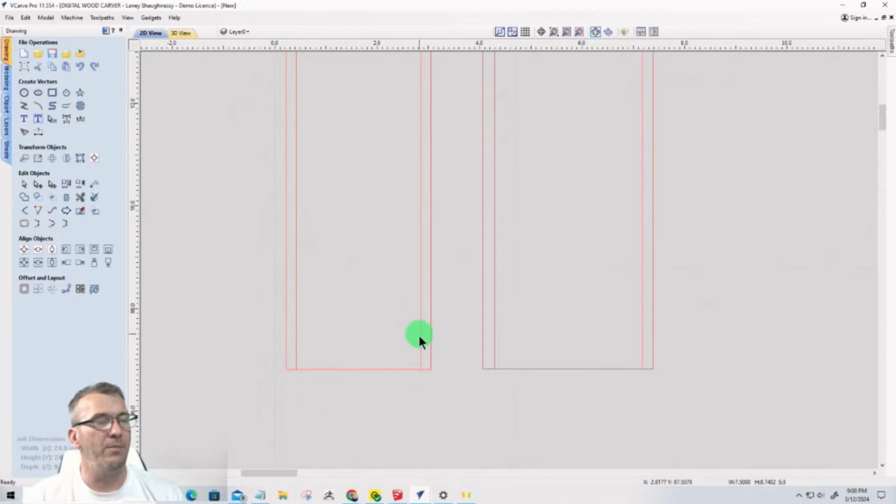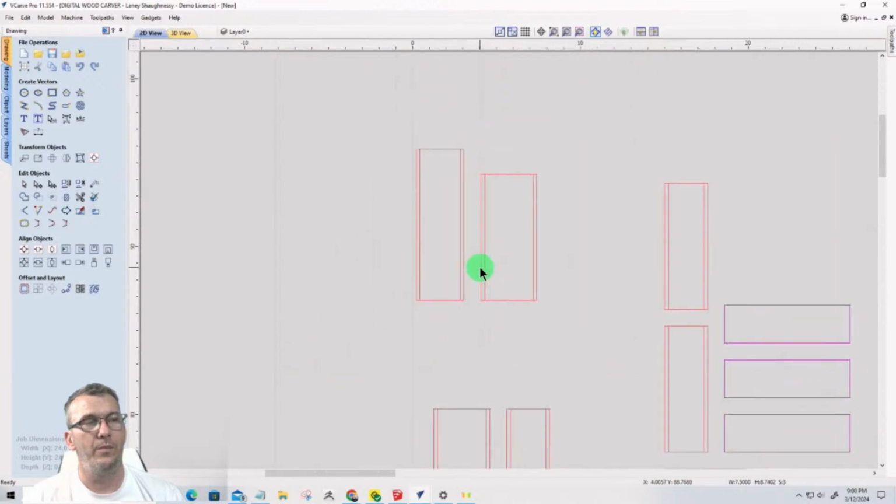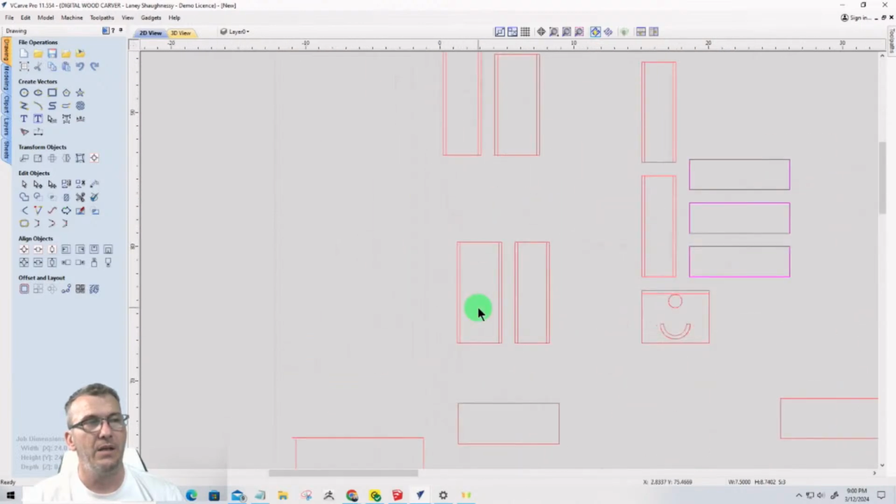And what we have to remember on this is, and again, I would recommend these fronts be cut on the table saw. Technically, with a ball nose bit and a chamfer bit or whatever, we could create some kind of angled miter. It's not going to be as easy as just tilting the blade 20 or 16 degrees and making our cut, flipping the board over and making our second cut, right?